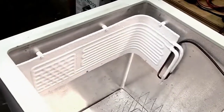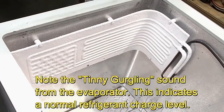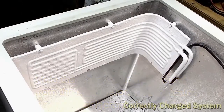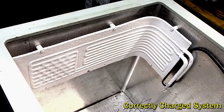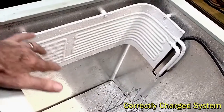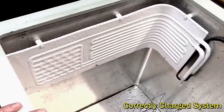This is our box — a top-loading old box — and inside we have a 130F evaporator plate mounted on standoffs, the three-quarter standoffs which are supplied with the evaporators. It is at least an inch away from the top of the box, and that allows warm air to circulate over the top of the plate and back down the back, freezing all the way down. So we are using both surfaces of the evaporator.